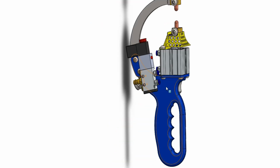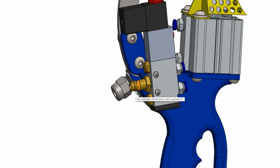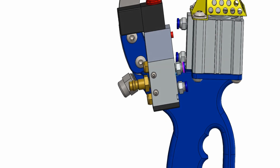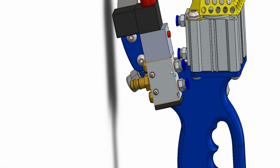So pneumatic air is passed in through this Euro coupling here, and this is using a flexi hose off the roof I use in the garage. Air is passed into the pneumatic cylinder here. There should be polyurethane pipes on here, but there's not. Polyurethane pipes are selected because nylon's too rigid, because they go around these corners. They're very sharp. Everything's very complex.